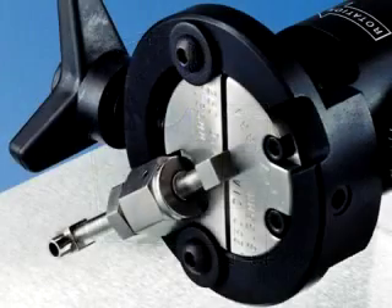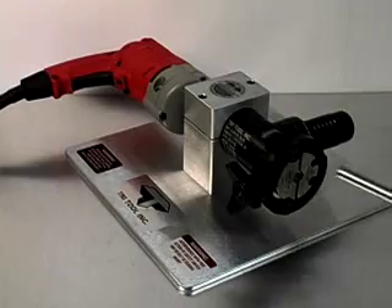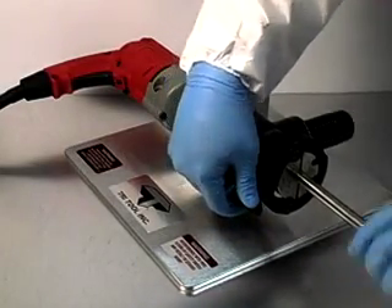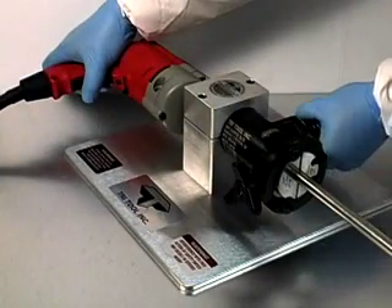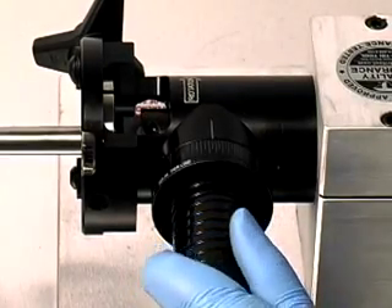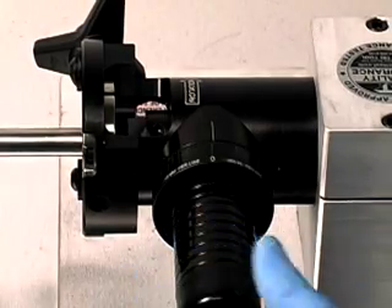The machine face and special saddles have unique cutouts that permit working with micro fittings. With the auto-retract system and micrometer feed indicator, you can produce accurate square ends on all types of materials with excellent feed control. The Model 301 SP's cam feed system slows the forward travel as the bit makes contact, so you get excellent tactile feedback.